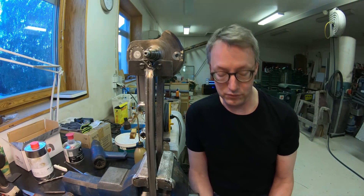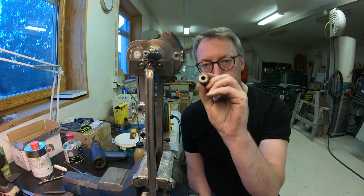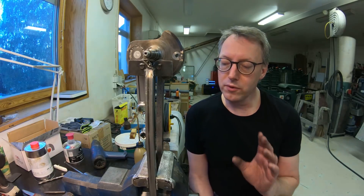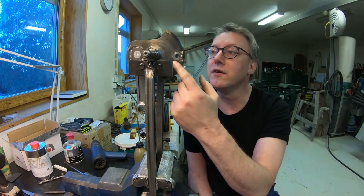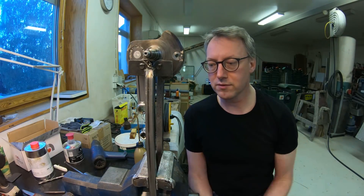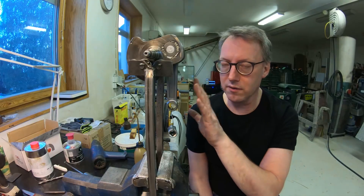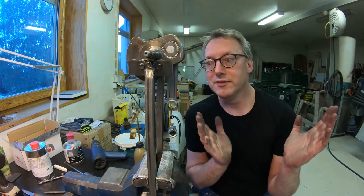Fortunately I had machined a 20-millimeter hole straight through both cheeks — they are hardened, so that's nothing you do in a normal drill machine. I played around with having this empty and having it filled with tungsten-copper heavy metal inserts and then drilling them out, trying a couple of different balance ratios. None of them worked without the counterbalancer, so now that I'm adding a counterbalancer again I saved an 8.3-millimeter hole to get ninety-eight grams on this radius. It looks like I've found an equilibrium — twenty-one thousand ten gram-millimeters on the crank and eleven thousand five hundred on the counterbalancer, all in theory.